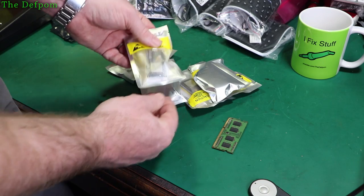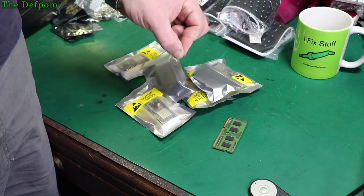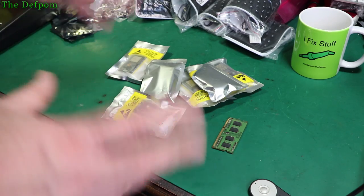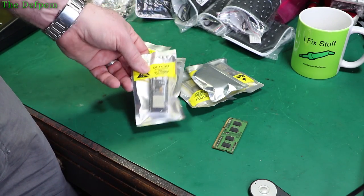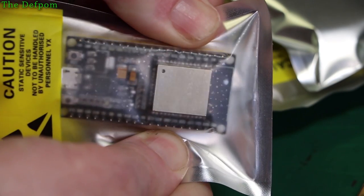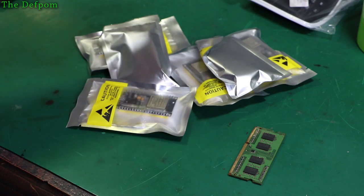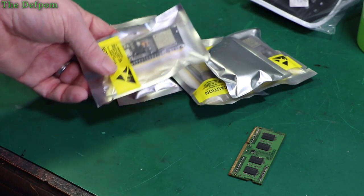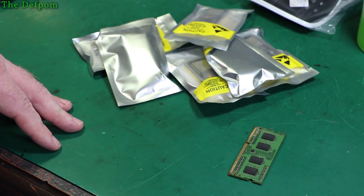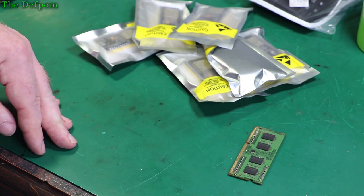We have some modules, which are the wrong ones. I've purchased two lots of these now and I've purchased the wrong ones — the DevKit V1 ESP32 modules, which is what I've designed my project around for its pinout and footprint. But I've purchased these ones instead which aren't the same — they've got a different footprint, more pins, and all pins are broken out including the ones going to the flash which you can't use anyway. It's not recommended because it can cause all kinds of weird stuff like stopping booting. I've now got about 20 of these which don't work on my project because I wasn't paying enough attention when I purchased them. I've since purchased the correct ones.